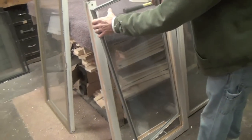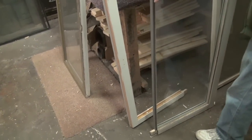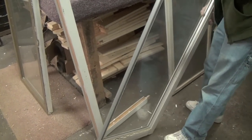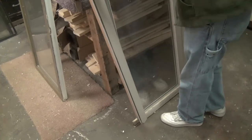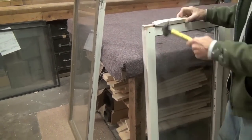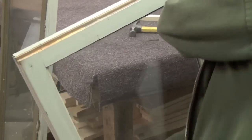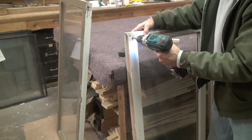When you buy a new piece of glass, put the sash back together the same way that it came apart. Gently knock the pieces of the sash in place using a wooden block and a hammer. Don't hammer your sash directly or you could damage the glass. Install your screws and you're done.